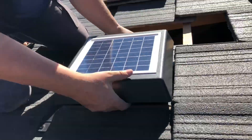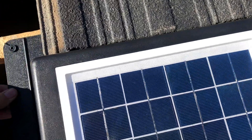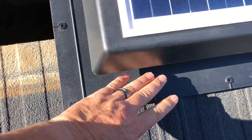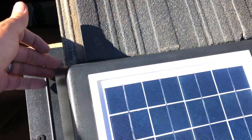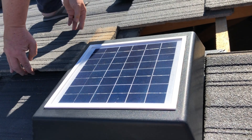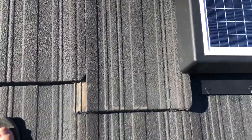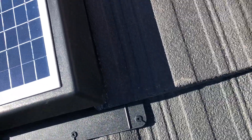That is actually right across now. We can put a screw in to hold it in place here, and we can slide the tile in order to put more screws. What we want is for this to be up above the tile so water sheds off on this side. We're going to tuck it under the top edge so water comes in and flows around properly. I think it's going to be able to stay full size — that tile is going to go right back in place right beside it. It's got a little spill tray at the bottom.